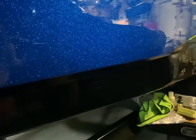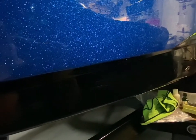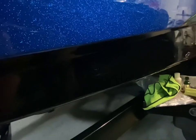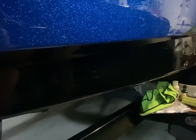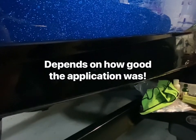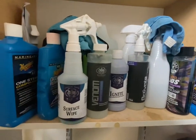If you're not using ceramic you're going to have to wax your boat probably at least every six months to keep it nice and shiny. With the ceramic, depending on the water conditions, you can go a couple of years as long as you use the supplemental spray which Marine Nano Shop supplies — I'll show you that in a second.